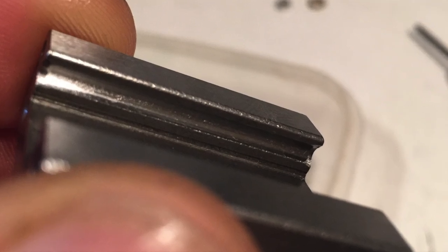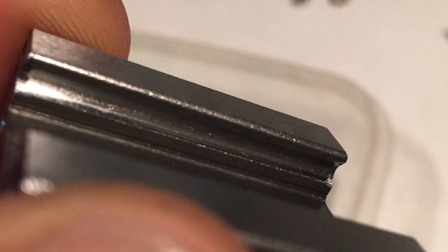It's a little hard to show in the picture, but the race is a lot smoother. And the boreholes where there was that line where the machining didn't quite match up — that isn't here. Under the microscope you can see the machining is not fantastic, but it doesn't have that hard non-matched line like the others did. The race is still a little bit rough but much better than the previous ones that had much bigger, deeper pockmarks. Not great machining by any stretch, but it is better.